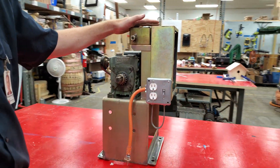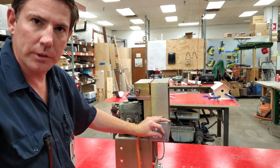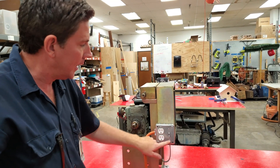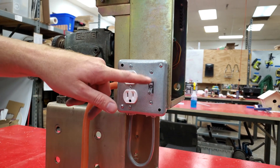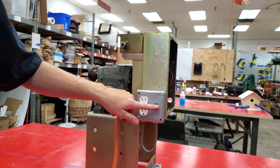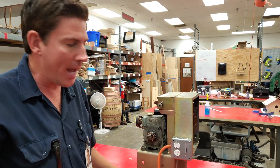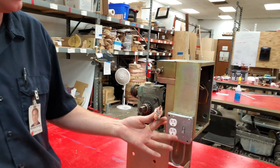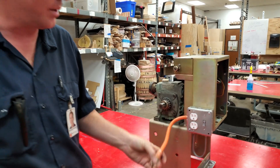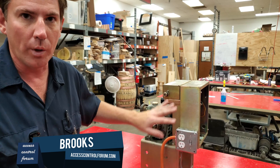You've seen a couple of stages before. What we've now done is we've added an on-off switch for safety on the outside. It's a lit switch, so when the circuit is off, the LED — or whatever the bulb is — will be turned on in the configuration that we have. We've got two outlets that are energized all the time, and then we've just got a 10-gauge plug that's grounded, so the whole chassis is grounded. We've already put it to the test and it works perfect.